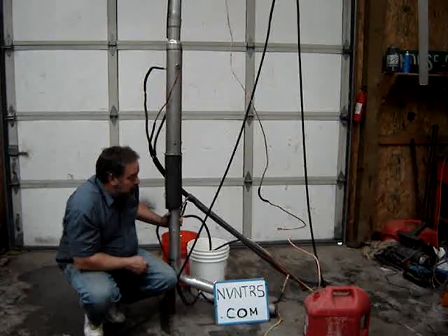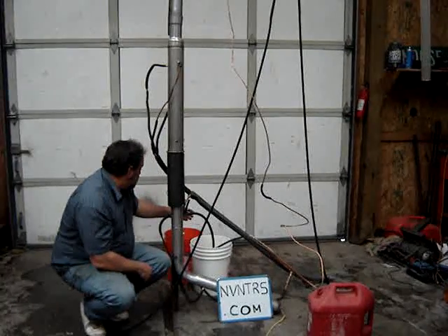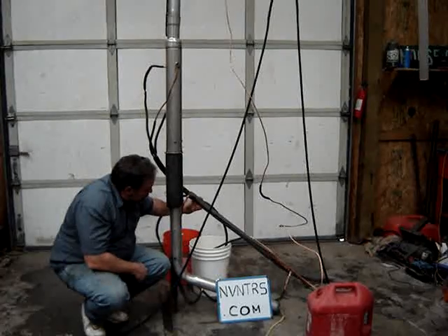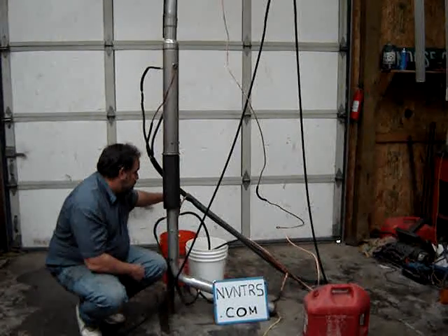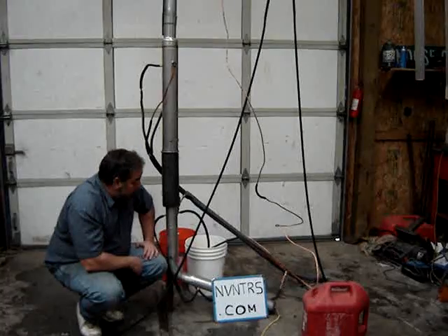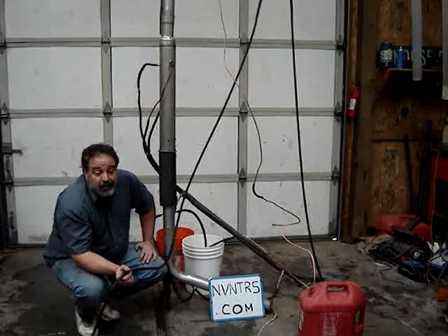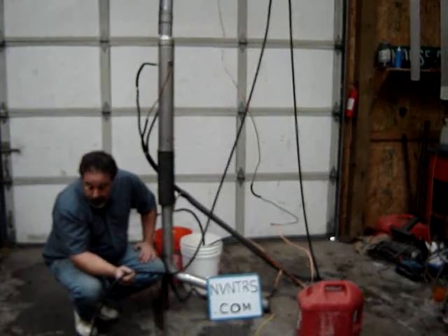There are three different heat exchangers in this system. After the beer comes out of the heat exchanger, it comes back into this level right here, and the warm spent beer falls into the waste. As you notice, there are no moving parts. The only moving part of the entire system is a pump. You require either a pump or fairly good gravity — but a pump to pump the beer in.